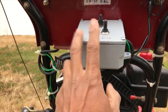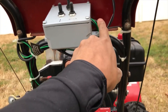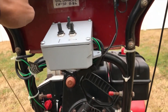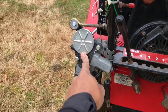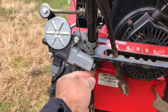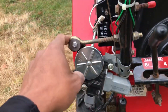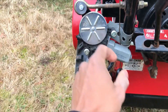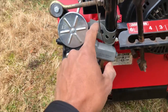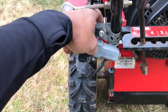The DC output connects to the light and to this motor — which I picked up for ten dollars from a scrapyard. It's a window actuator from some random car. I repurposed the bracket that used to hold the manual chute turning system to hold one side of the motor. On the other side I used perforated sheet metal strap from the hardware store — you can buy it in four or five foot lengths — wrapped it around the frame and connected the other side to it.